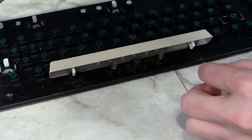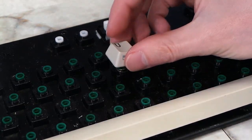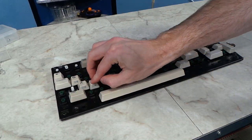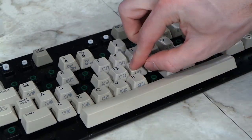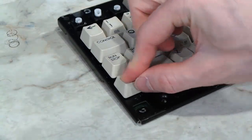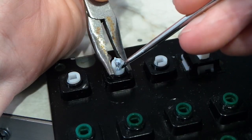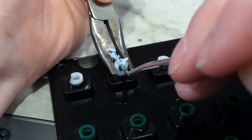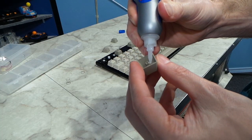When reinstalling the keys, I always start with the big keys first since they are a little tougher to put on and it's easier when the other keys aren't in the way. It's always fun watching the keyboard take shape as I randomly reassemble all of the keys — and of course, we can't forget the most important key, the Commodore key. I wanted to fix the broken key and kept trying to figure out what was in there. After a while I determined it must have been chewing gum — somebody apparently thought that was an appropriate way to keep the key on. With it being broken, the key certainly won't stay on by itself, so I just added a few dabs of super glue and that seemed to fix it.